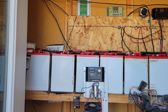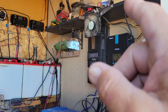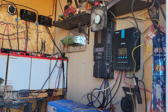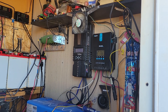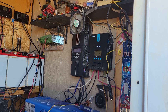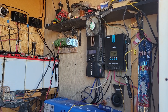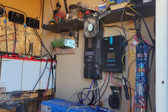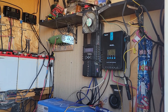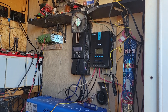Make sure you leave gaps between the batteries — that's a very important thing. Get yourself good controllers. I am very partial to the Midnight Classics, which come in the 150, 200, and 250. That number is not about which is better — it means that's the maximum voltage you can put into the system. But Midnight has a clause in their book that lets you add the voltage of your battery bank. So for a Midnight 150 with a 12-volt battery bank, it's actually 162 volts maximum.